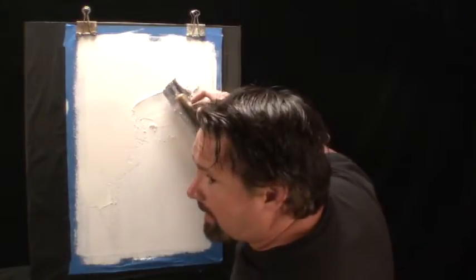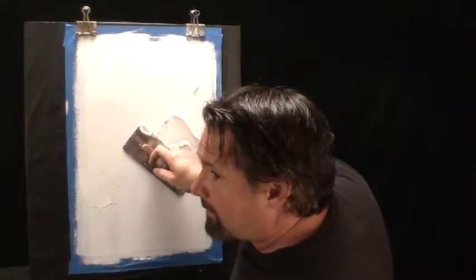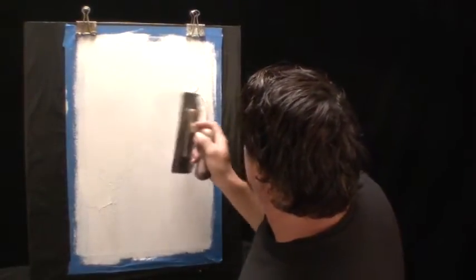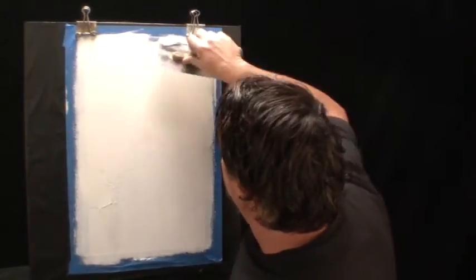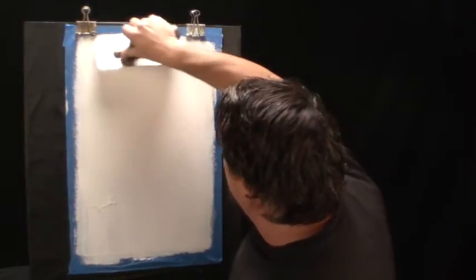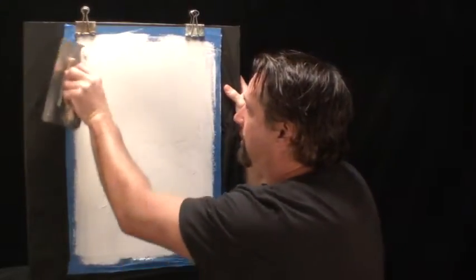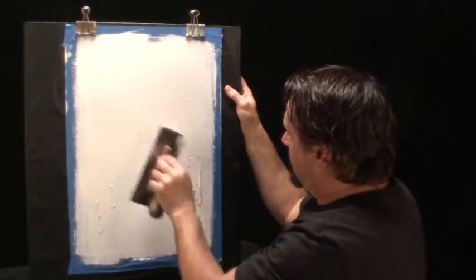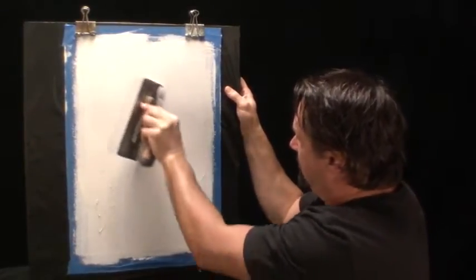And then I come back and I'm kind of high up on the edge. So it's almost flat, up on the edge. And you can hear the aggregate in it as it goes across that base. The thing about the grasselo is it's a very thin plaster, and imperfections will telegraph through. So when you do a base of your marmorino like so, it buries all those imperfections that are on the wall, and you're going to get that super glossy, glassy look that you're looking for.